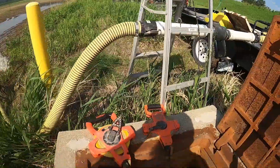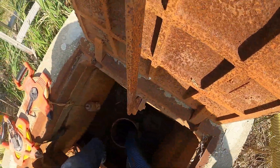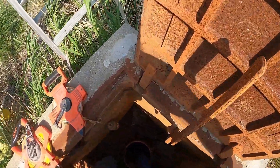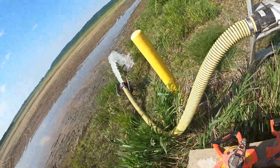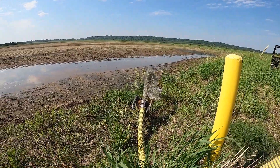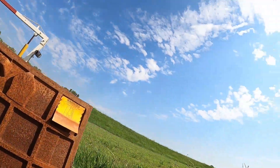A little bit of a chocolate fountain there — that's the rust and sludge at the bottom of the well. We'll go down and hit that one more time and then let it pump for a few minutes until we get clear water. Just some gray water that time, so we're pretty clean on the bottom.